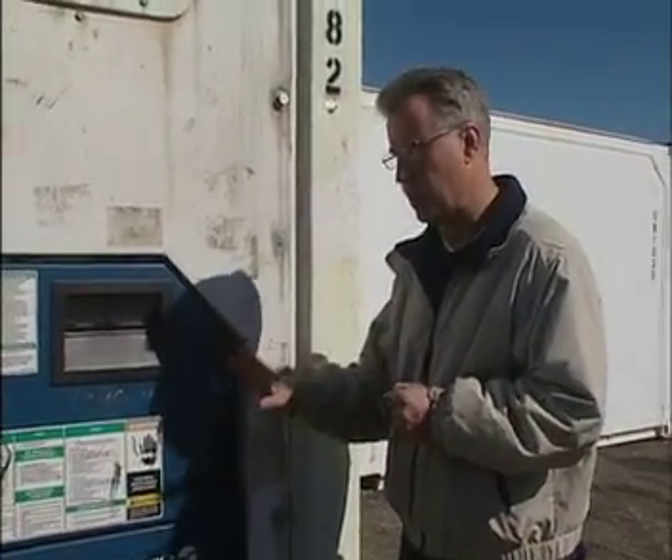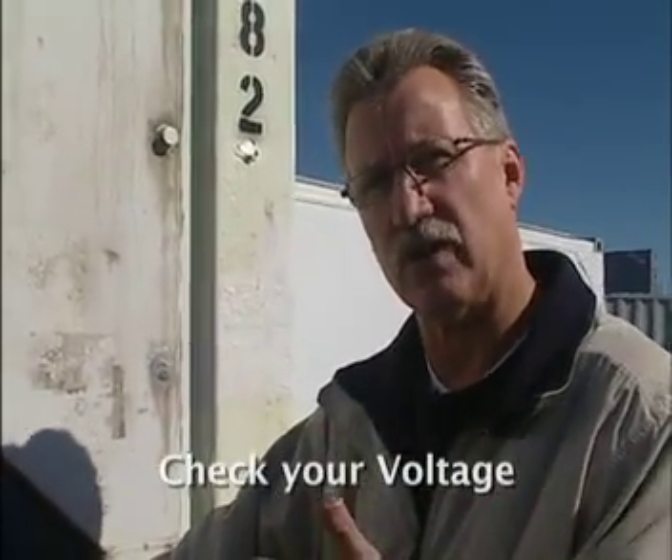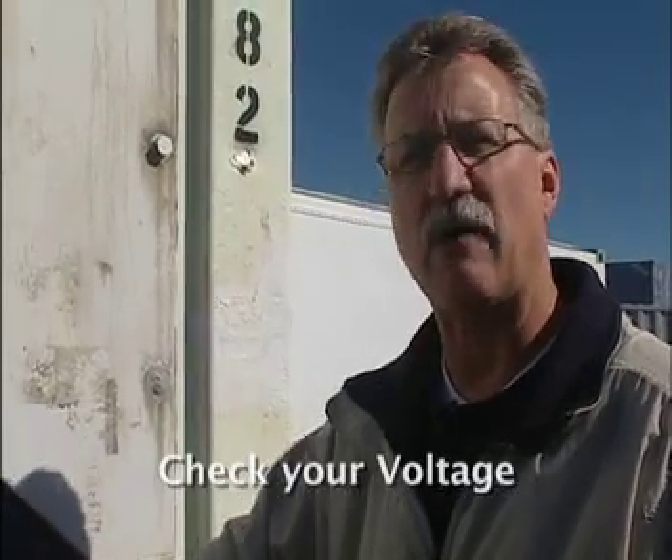When we rent these containers to customers, some of the challenges we experience in getting the unit connected and operational include customer power issues. A lot of locations have low voltage — 208 volts rather than 240 volts. The electronics in this system are challenged as the voltage drops, which increases the amps, develops heat, and creates problems. We recommend that the customer confirm, even before we deliver the unit, that they have at least 220 volts of three-phase power. We also have special transformers that can take 208 volts and turn it into 240 volts, which will make the unit run well.